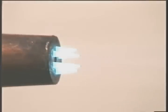When you have a neutral flame, push the oxygen cutting jet lever all the way. If the preheat flames change, you can readjust the oxygen a little to sharpen them up.